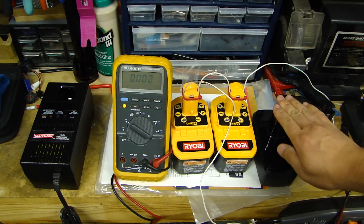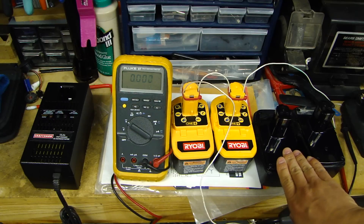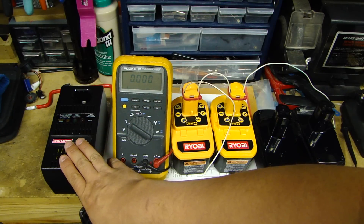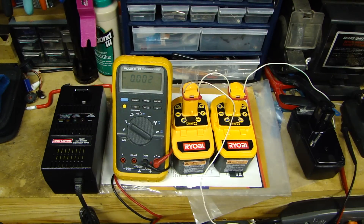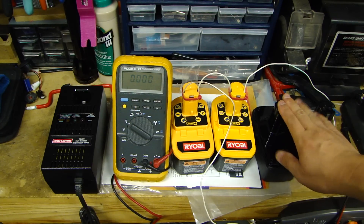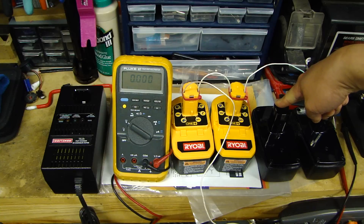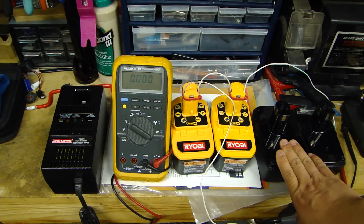After zapping it, let the battery sit for a good 15 minutes and let it cool down — internally there's some heat buildup in the cells. After 15 minutes, grab your regular charger that came with your battery and plug it in to charge it. The procedure I've read is: zap it, wait 15 minutes, then charge it. If it doesn't work you can try zapping it again. If you try this a couple of times and it's still not working, then one or more cells could be completely dead — just bad cells — and there's no rejuvenation for those.